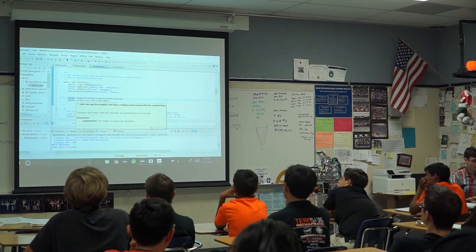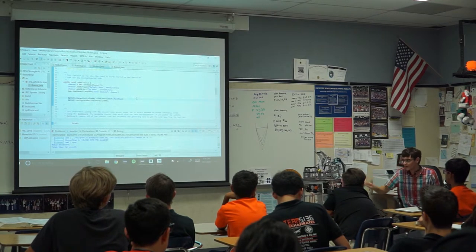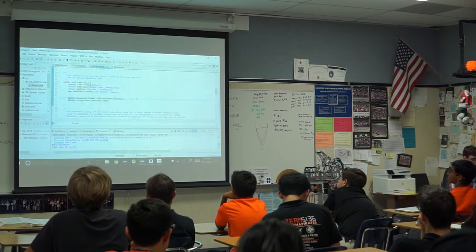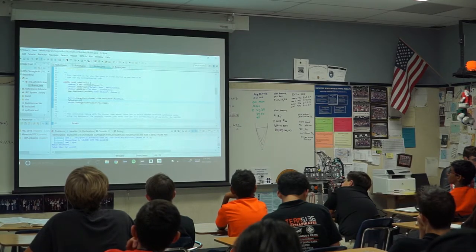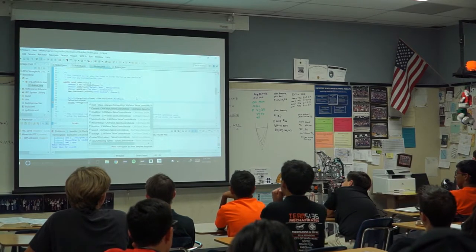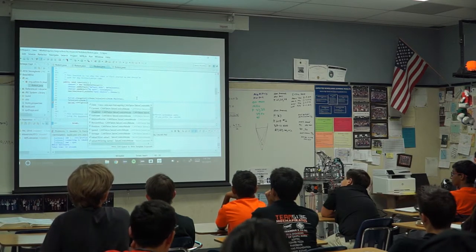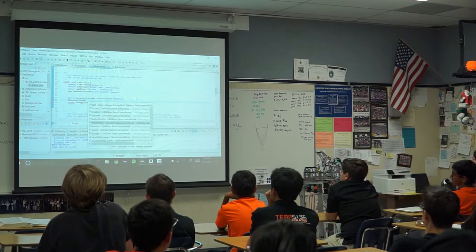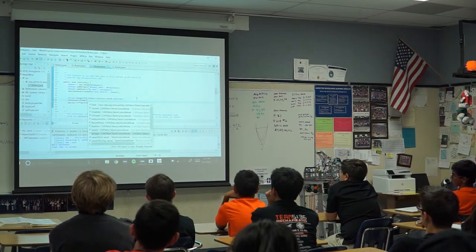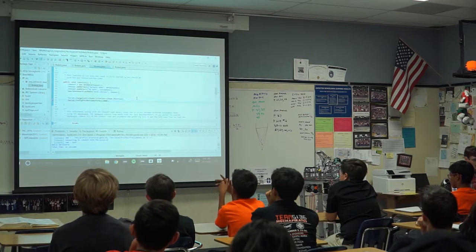First of all, I have to tell it that we are controlling its position, our turret specifically, this thing. We're not controlling how fast it's running, we're controlling where it is. There's actually a lot of things you can control. If I look at the auto-completion, TalonControlMode dot, you can control the current, so you can make sure your motors never fry, hypothetically. I have not tried that, so don't take my word on that. You can get it to do a motion profile, a percent of the voltage, position, speed, the actual voltage, et cetera. Anyways, we're just going to do position because that's what we want.